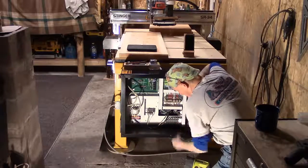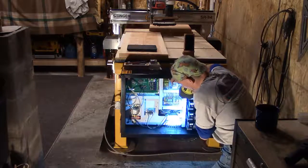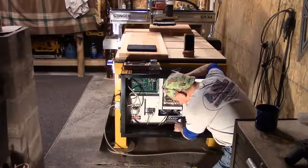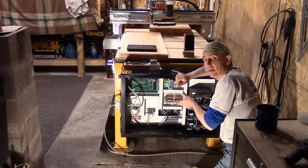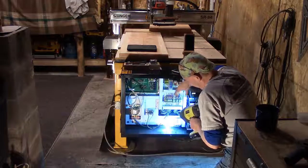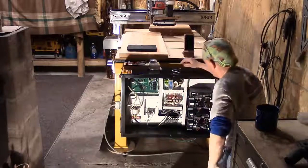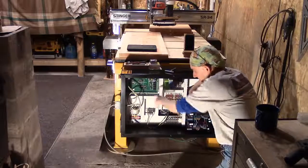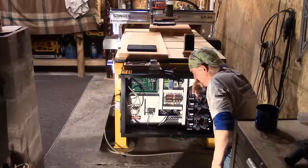Down below we have seven little glass fuses — I think they're 50 volts. They're like the old-style round glass tubes we had in cars back in the 70s. Check to make sure all your fuses are good. I will say this: I don't know if on startup some of these have a capacitor in them, so don't touch any open metal terminals because something can still hold a charge, and you don't want to start yodeling in the middle of your shop.